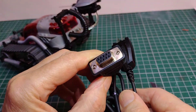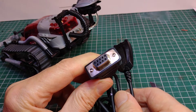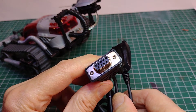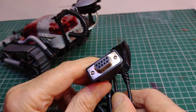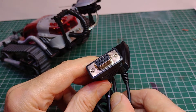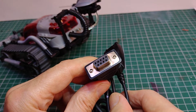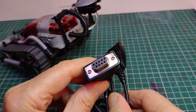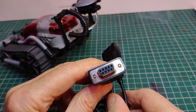It happens to have what is called an RS232 connector on it, but most computers don't have those these days. What we could use — though I haven't tried — is a USB to RS232 cable, which are readily available. I happen to have RS232 on my computer, so I can control this directly, not using the original software but using BrickX and not-quite-C as a programming language. I did a video on those, so hopefully I don't need to go on about that.